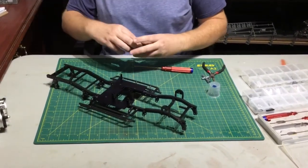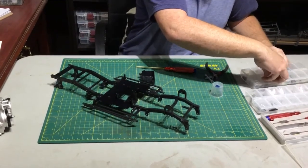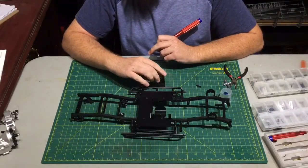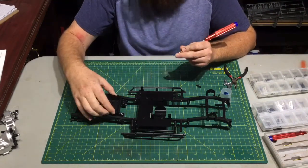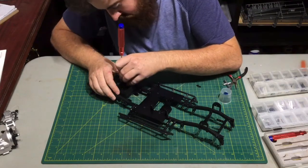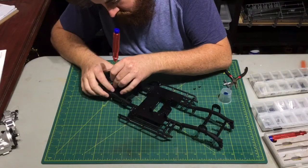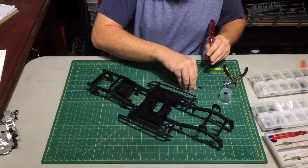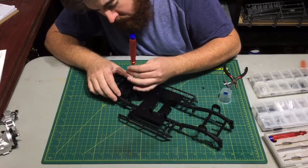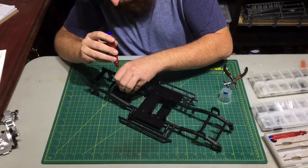Okay, next is the electronics box. This is held in by some M3x8s, 4 of those guys. The electrical box requires M3x8, the countersunk. With this box, it's got a couple of positions, but I want it centered. Won't tighten them fully, just that way we can get everything aligned. Again, using thread locker as we're going metal on metal. These ones that are a little deeper in will be a bit more challenging to get, but very much doable.